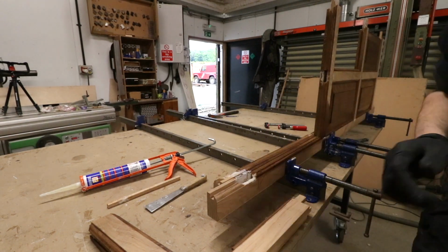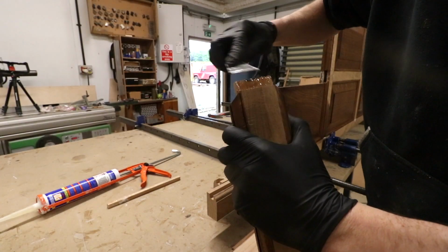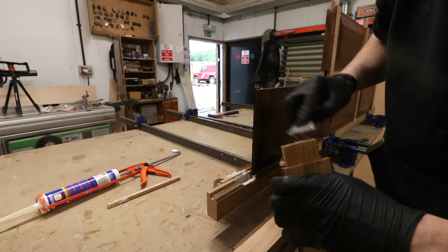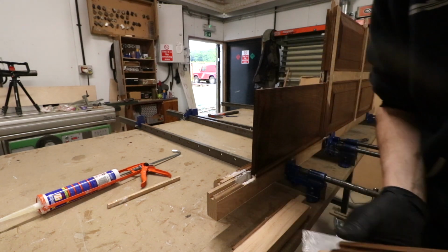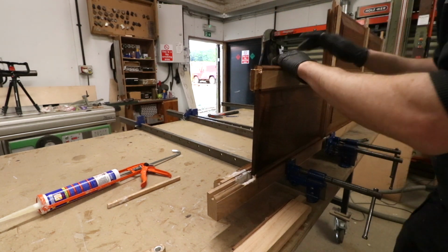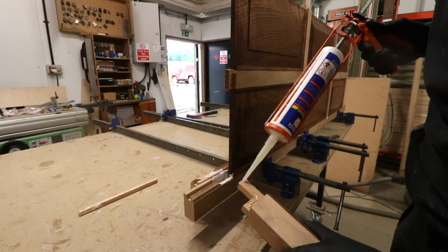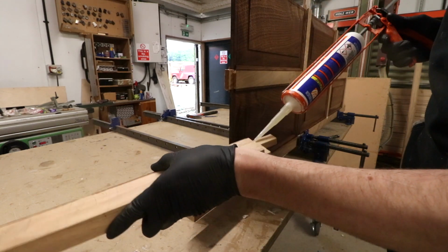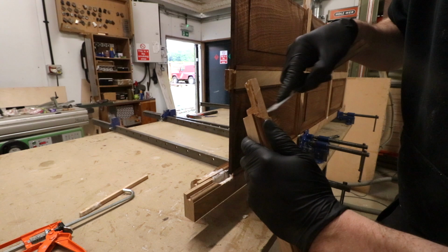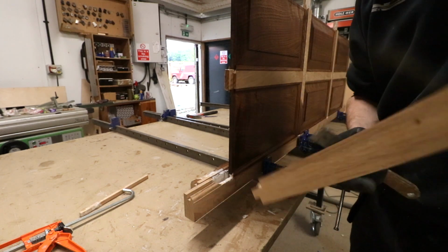Make sure everything's coated. I know we're in a bit of a rush, but the strength of the joint relies on everything having been covered in glue. Remember that the end grain does soak the glue up as well, so PU is quite good because it does foam up a bit, so there's always glue on the surface, even if it's soaked a load of it up. There's always glue there to actually make a bond. Sometimes you can see Cascamite, etc. will coat the end grain up, and then when you come to put it together, there's no glue on the joint, on the end grain, because it's soaked it all up. So you have to reapply the glue, and you'll see that again when the door's dry. It could have soaked up all again, and the joint's not actually very strong at that end grain shoulder because it's physically just soaked all the glue up into it. So I do like PU glue for that fact.